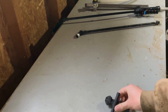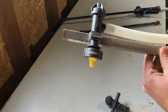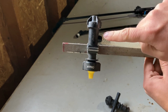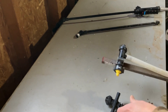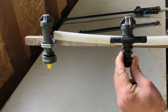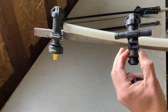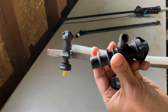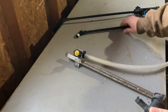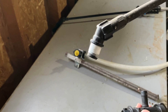This would be a dry boom nozzle body because you would connect hoses to it and clamp it to your boom pipe just like this. There is the L-style, which would be on the end of a boom section where you just have one hose coming in. This style would mount further up the boom so you would have a hose coming in and out to supply the other nozzle bodies. This is the modern upgrade — a really useful version.